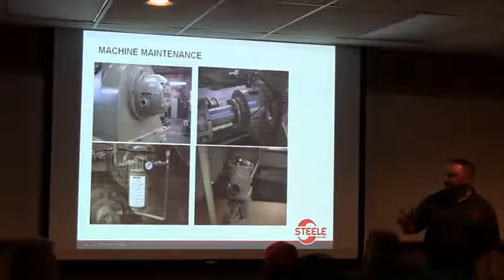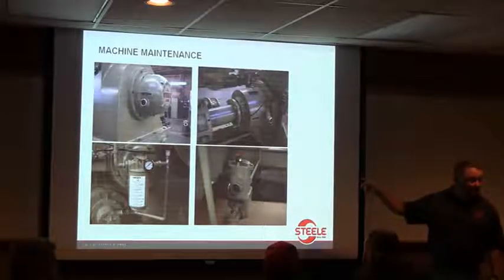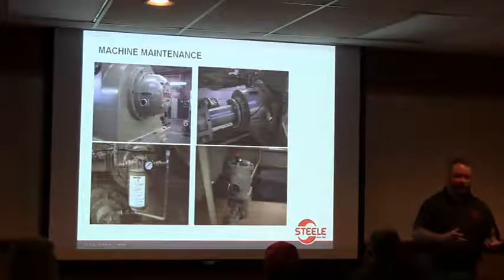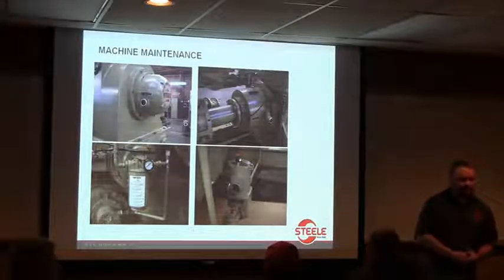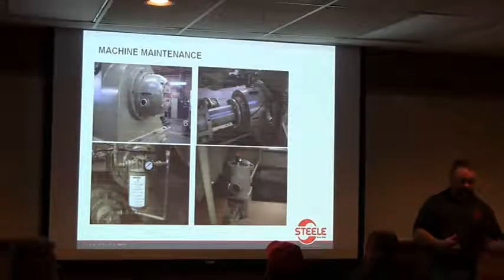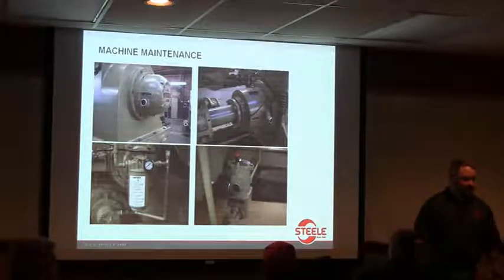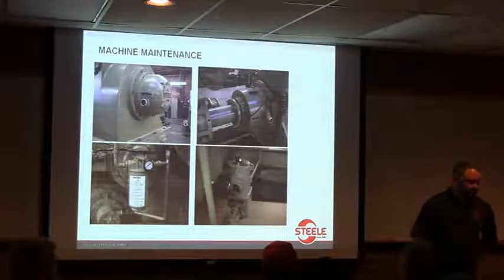Well, I've watched them assemble one in the shop back at Statesville, and they had to heat the bearing up on that machine that they've got there. I don't even know what the machine is called. Just a bearing heater. A bearing heater in the shop, yeah. And after they heated it, they were able to slide it right on. But they pretty much said that if you don't heat it, then it's not going to go on there.